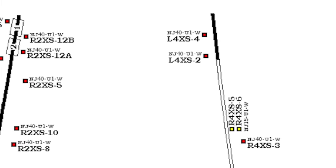We get that first set of proxies, which says stop the train, stop the chain rotating, and close the hydraulic brake. That way the train does not roll backwards. And at the same time, actuate those pneumatic rams and drop the trough down. And then when it does that, the train starts to roll backwards. Also at the same time, that's the command to open the safety brake.